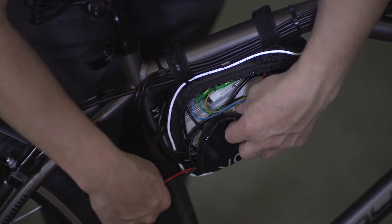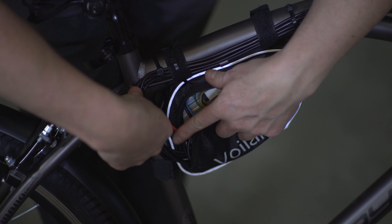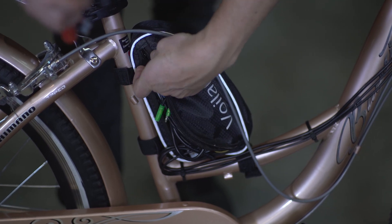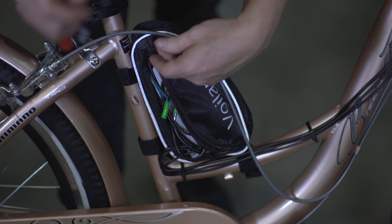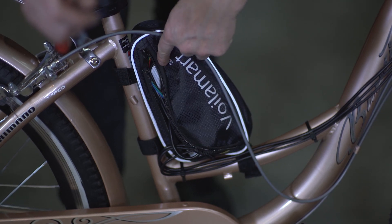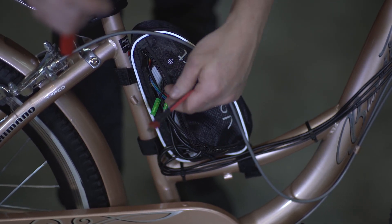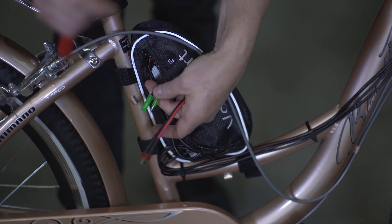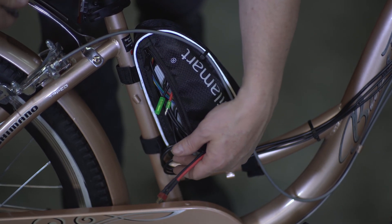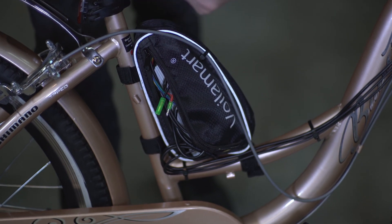Now you'll see that this is actually going to come out the bottom here and give me a little pigtail so I can string this up and wire it in this way so that I have a line going back to where my battery packs are going to be. On my wife's bike I thought about poking a hole in this bag up here so the wires could come out of that hole, but then I started thinking about if it rained — water dripping down in there is a really bad place for water to be. So I think what I'm going to do is just go straight off of these wires, solder those together, and have a longer pigtail — maybe 14 inches long — come out and connect up here by the time it goes to the batteries.